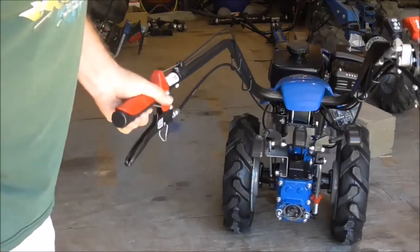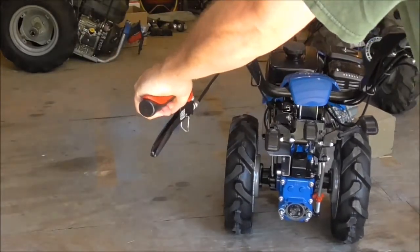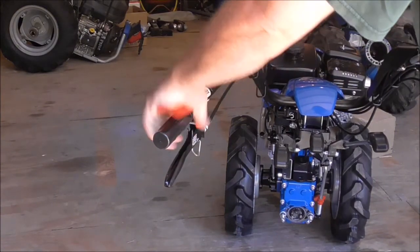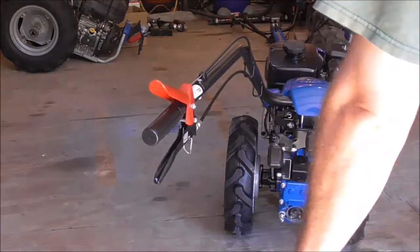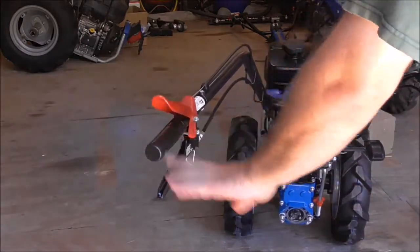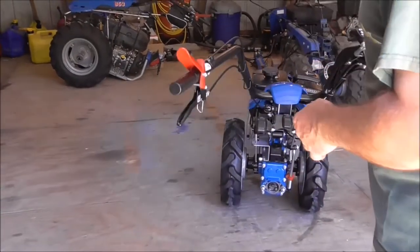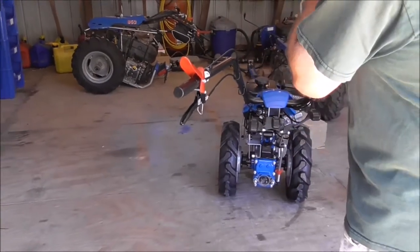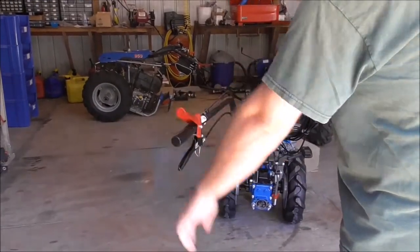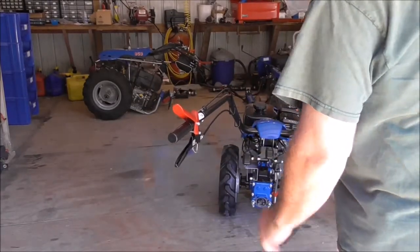When you're working, your hand's always going to be right here holding this down. The machine's running and you're tilling, mowing, whatever you're doing — you let off this, it's going to kill the engine. It works differently depending on the model. On the BCS side, some models when you let off this, it just stops the machine instantly and the engine stays running — those are what they refer to as their power-safe models. On the non-power-safe models, it stops the spark on the gas engine and the machine slowly comes to a stop once the engine dies.